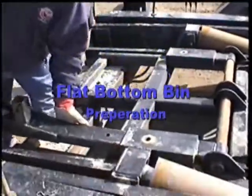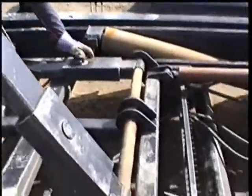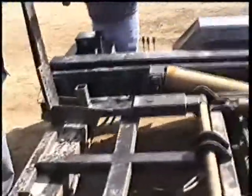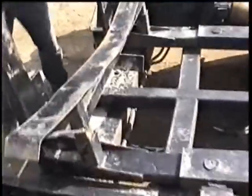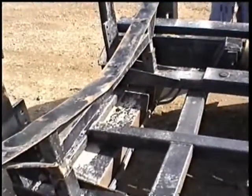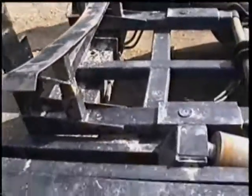Now we'll get the forks out from the front of the trailer. To complete this, you put a bumper pad in so when you're backing up to the flat bottom bin, the forks obviously go underneath the floor and this bumps up against the bin. Pin your bumpers down, because if you don't and that bin is not perfectly centered, it will roll and actually lift. It's important to include the pinning to keep everything tight.